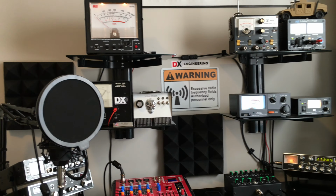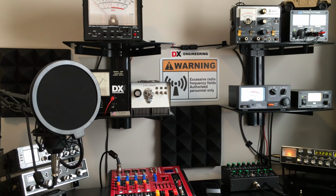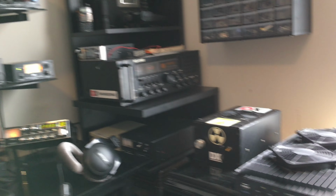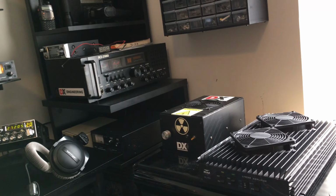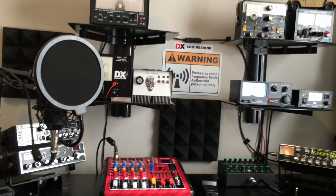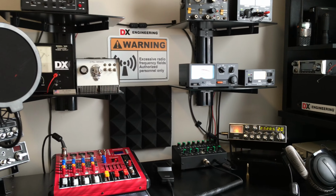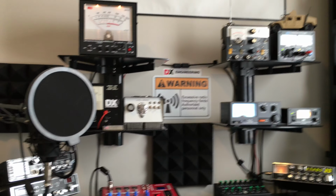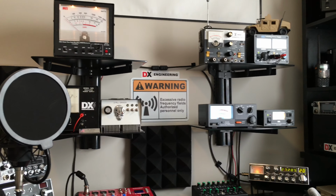So, you know, like I say, it'll take a 3 pill, 3 Toshiba transistors to do what this 16 MOSFET amplifier is doing. But it's a very, very clean amplifier, and the DC filtering is great. There's trap filtering in there as well. Produces a very, very clean signal, more linear than what you would call a linear amplifier.